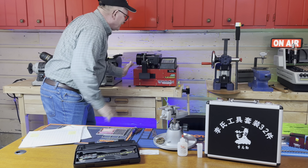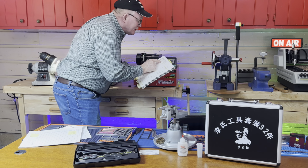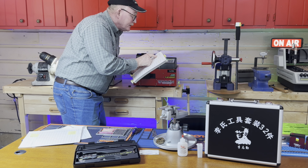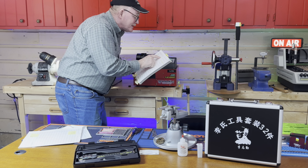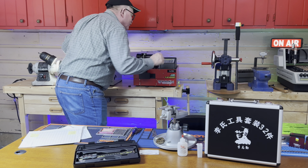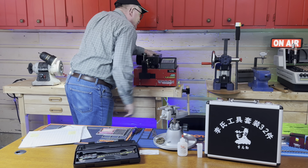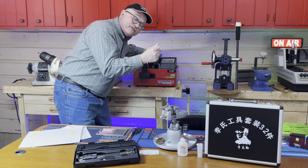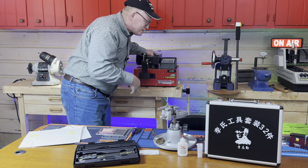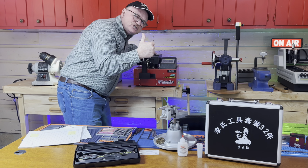Oh, isn't that cool? All right, so it's alive. Now I take my little book, page 54 in my book, and it's under Sargent LA key. Just look at my book, and I set the manufacturer up to 388. Let's do that, 388. 388 manufacturer. It's set up. It woke up that fast. It's not like some of these other key machines where you gotta wait for the booting and all this software and all this stuff. It's embedded in the ITL already. Great machine, I love it.